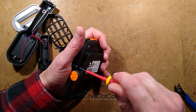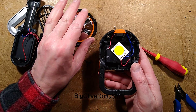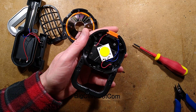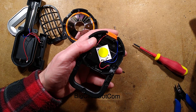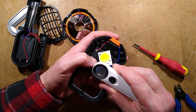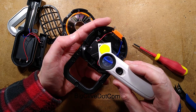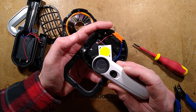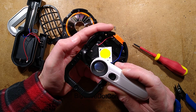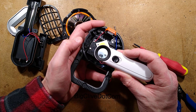I can feel the front coming off - it's off! We do have resistors. There's also one little transistor-type component - that's doing the flashing. Is it marked? It is marked. The resistor is marked 1 ohm, and that component is marked 2824A - that's the flasher chip.